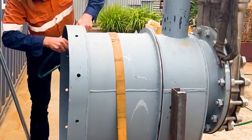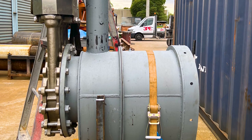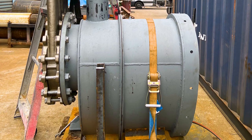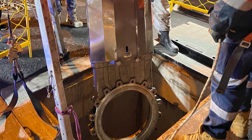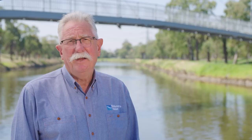The team used out-of-the-box mitigation to come up with an innovative new solution. A mechanical plug was fabricated specifically for the ovoid shaped pipe, providing a safer environment for the workforce and control of the flows to prevent sewer spills. The blade-type valve also provided a lockout point for the flow isolation system, which is otherwise unachievable with traditional inflatable plug isolations. This proved much safer and a more secure method of isolating the sewer.